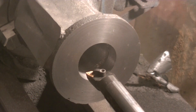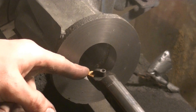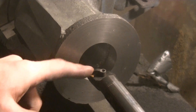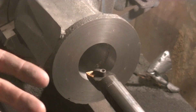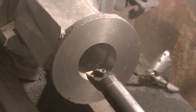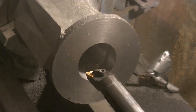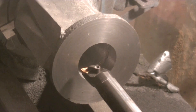It's about a week or so later. I have the new boring bar with the new ISCAR WNMG inserts. It was really hard to find these inserts — I ordered other WNMG inserts but they were too big. It's a trigonal pattern that inscribes a circle. The only size I could find was a half-inch inscribed circle, but these are a 3/8-inch inscribed circle. Not even McMaster-Carr had them — I finally found them on eBay. Let's see how this performs.